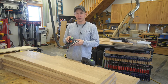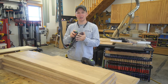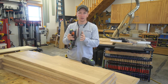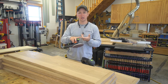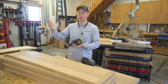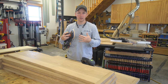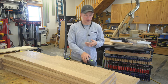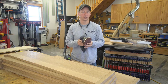One other key point: what grit of sandpaper do you want to use with these sanders? From my personal experience, I use 120 grit almost all the time — 99.9% of the time. It's aggressive enough to get out planar chatter, scratches, and gouges, but even on a stain-grade poplar beam it doesn't leave big ugly swirl marks. I have 120 grit on the Rotex as well as the ETS for sanding these stair treads, and that seems to work pretty well.